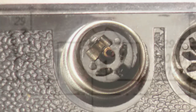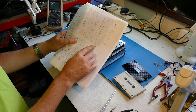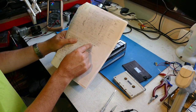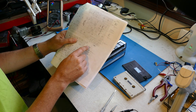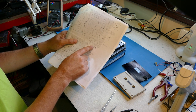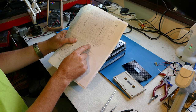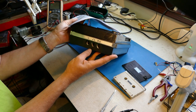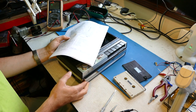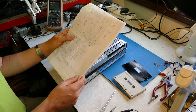Let me see if I can work out what the pinout is. Pins 1 and 5 seem to be the power, and it disconnects the battery. So when you insert a plug, it breaks the contact from the batteries. Well, not a serious problem for me since I'll never have any batteries in there. So all I need to do is find a way of connecting to pins 1 and 5 of this modified DIN connector and get the polarity correct. And then I can power it from an external power source. Let's patch that up.